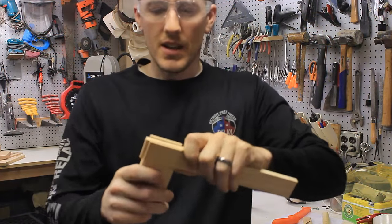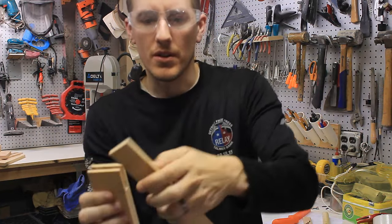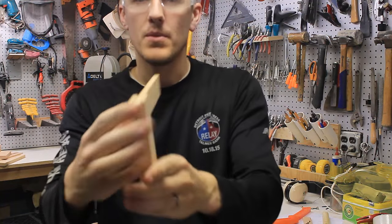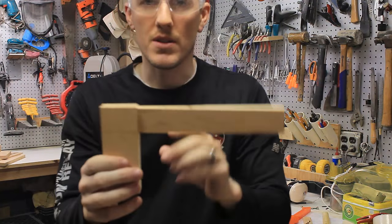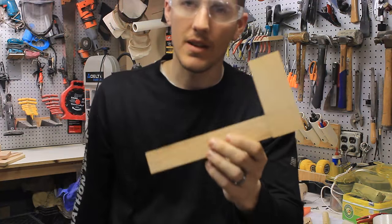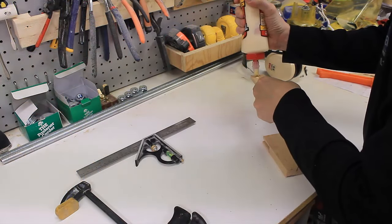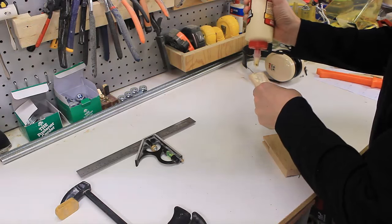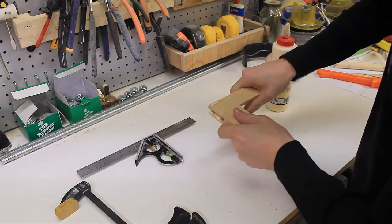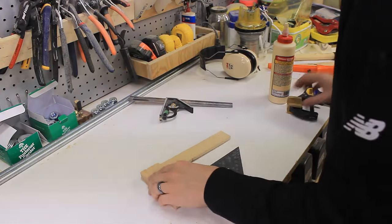Alright, I have it fitting nicely — nice and tight. I did narrow this board a little, it was a bit longer, and I shortened it to a more convenient size. I'm going to glue it up, make sure it's 90 degrees, let the glue dry, and maybe round over some of the sharp edges, but other than that, that's all there is to it.